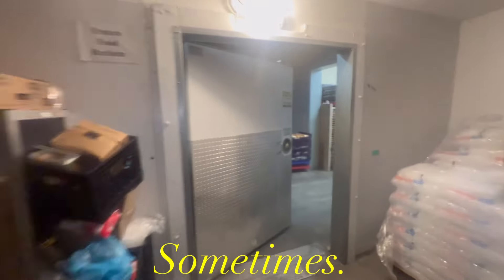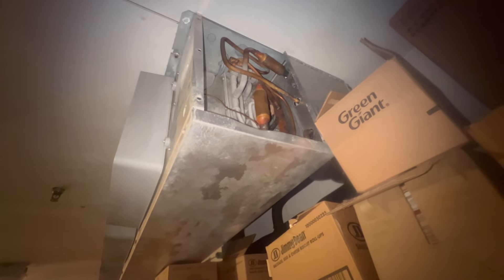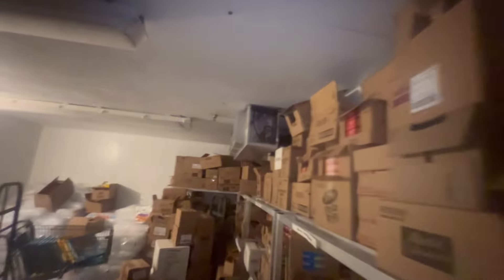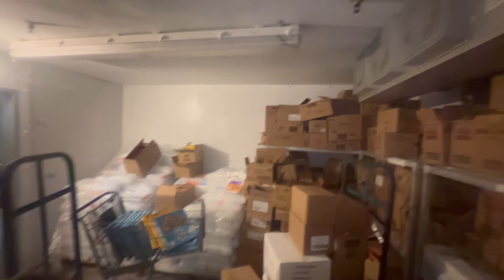Y'all can see the pressure drop, though. Most things are telltale. Guys, this panel wasn't even on, but y'all can see the pressure drop on this side also. Hopefully, it's a bit difficult to get in that tight behind area. But y'all can see the pressure drop on here. Coil clear, fans running. Rack good. We got compressors running. We had a ball floating - I think it goes up and down. But sight glass is clear.